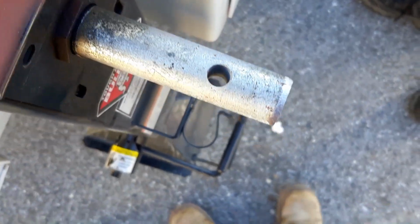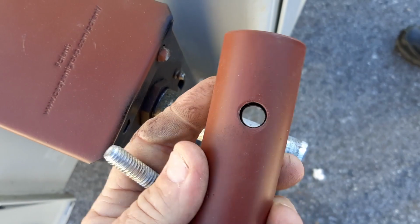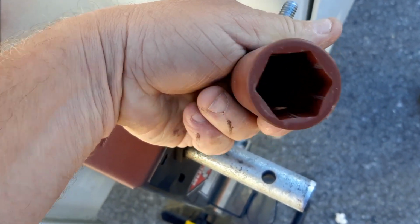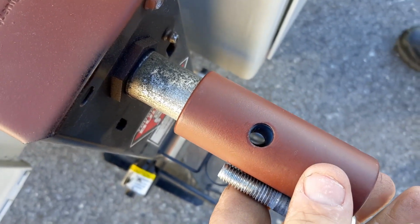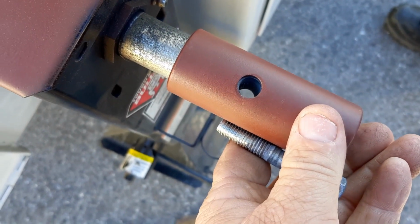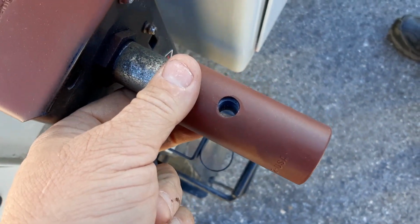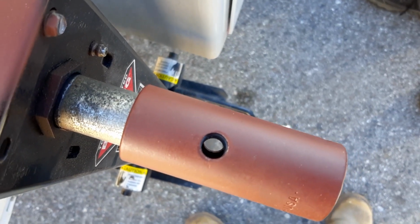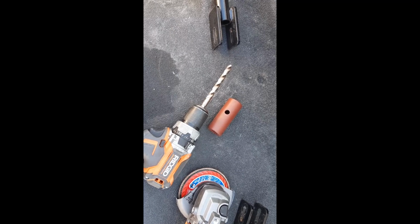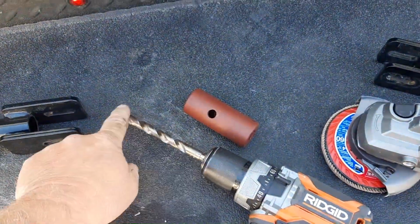All right, interesting observation. The hole is straight. My hole is straight, cut from flat to flat. But when you put it on, something about it doesn't quite line up. I'm going to have to adjust it. I'll probably have to run the drill straight through here to widen the hole on one side of the socket for some reason. The drill bit that I've been using is a 7/16.